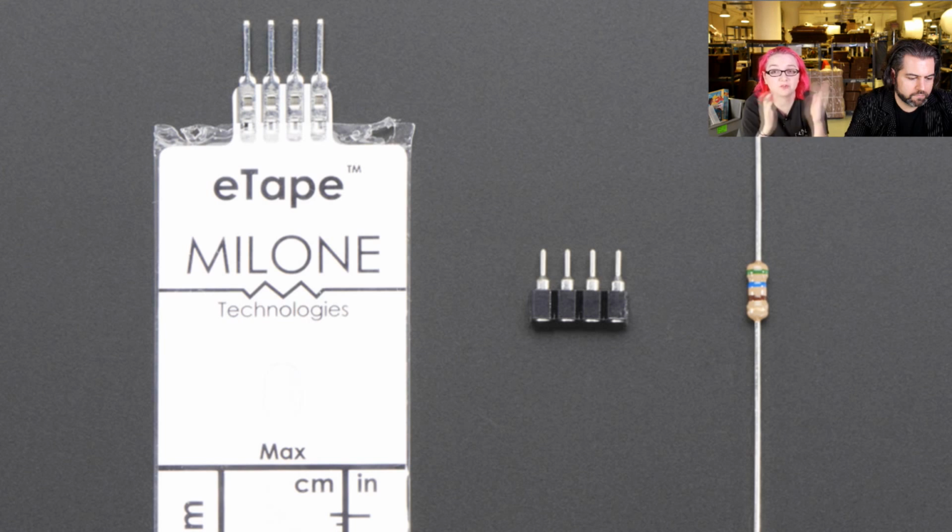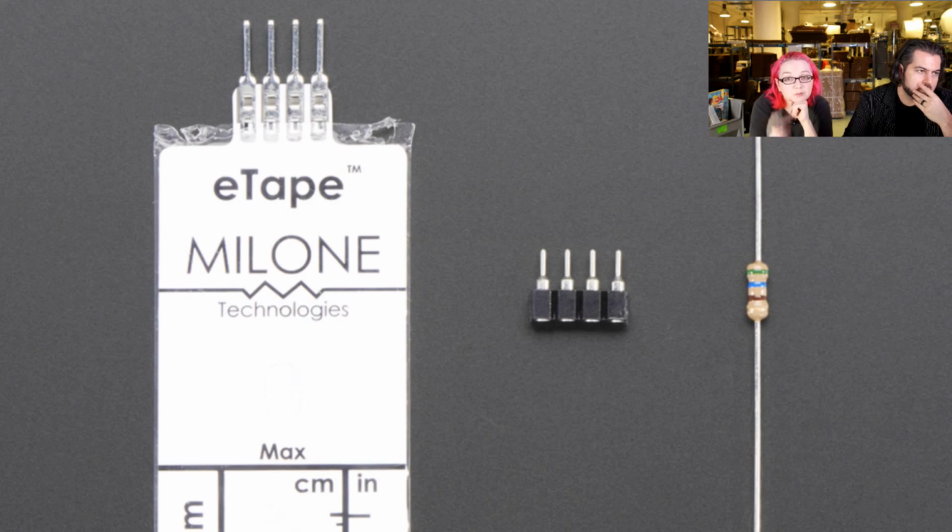It's a pressure sensitive sensor, so it's how much pressure is being exerted on it. It's sensitive, so when the pressure of the liquid is pressing up against it, the resistance changes, so you can measure that resistance.